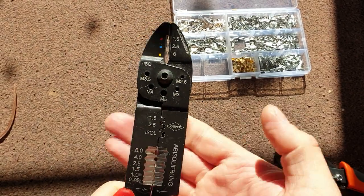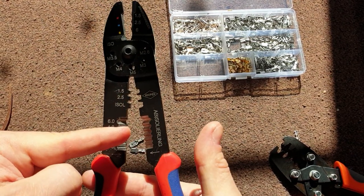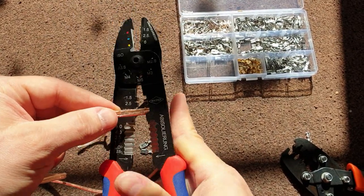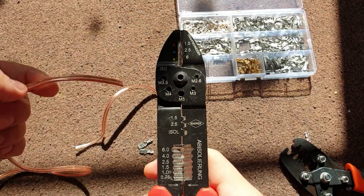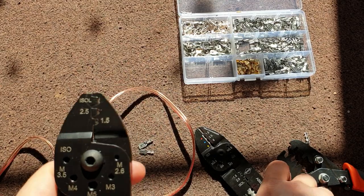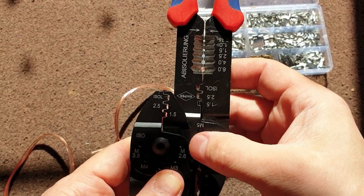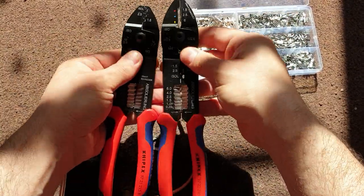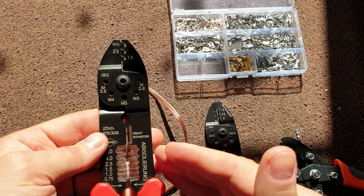Now the first one that I bought was this one, and I liked it a lot because it did squeeze good — the crimp was good. However, this crimping position is in the middle of the pliers. So when you have a crimp, you always have to go over the wire and then crimp it, and if you have a connection you have to remove the pliers all the time, which was very inconvenient. But these new ones have the crimps on the end, and they're much more convenient. Also, if you compare the distance between the crimps and the middle part, you'll notice this one is closer to the center, and since the handles are almost the same length you have more leverage with these — meaning you need less pressure to apply in order to get a very good crimp.